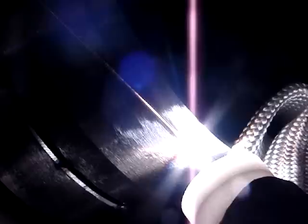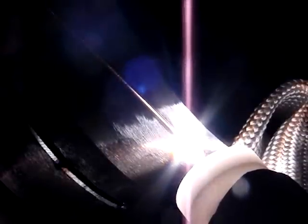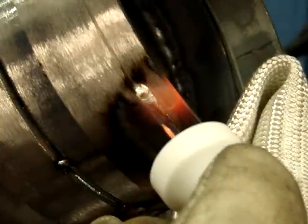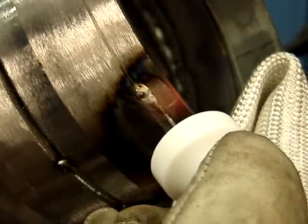You can hold it right next to the area where you're welding and go for long distances without your fingers screaming for you to stop. We're using the same straight forward and back technique here — pushing it forward, pausing, or maybe even pulling the arc length back a little while we add rod, all in a straight line. Either forward-and-back or forward-pause-dip — they're both very similar. I often pull it backwards and find that's a very good one-size-fits-all technique for sheet metal.